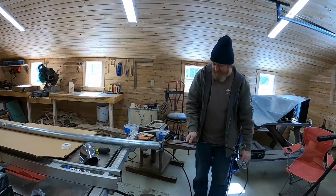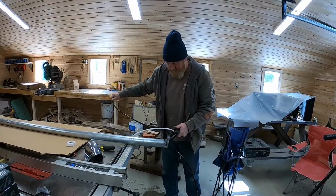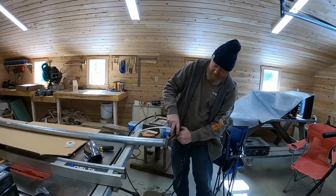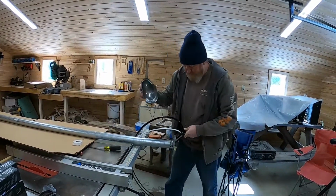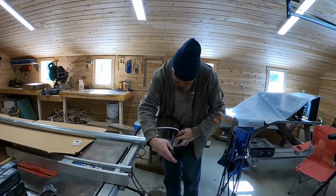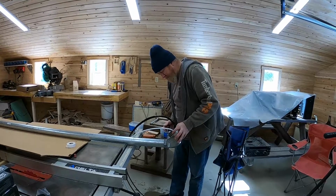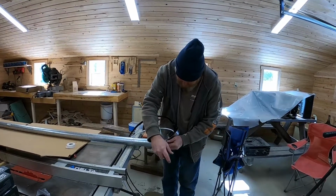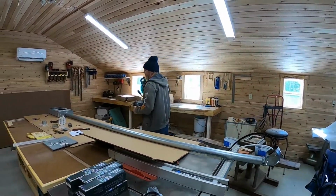And then we want to bring our 2 hots. And then we're going to put our weatherhead back on, holding everything just right, and tighten up our 2 screws. Just like that. That's pretty much it. Like I said, we'll do everything else on site.